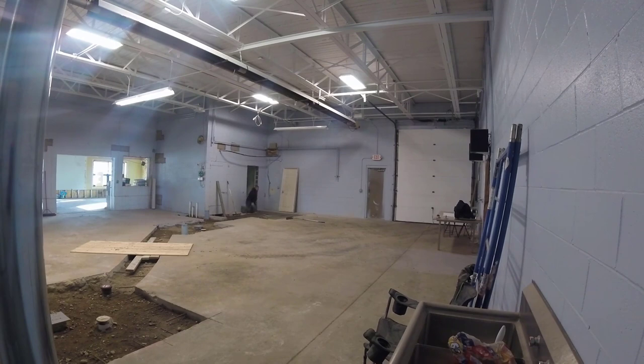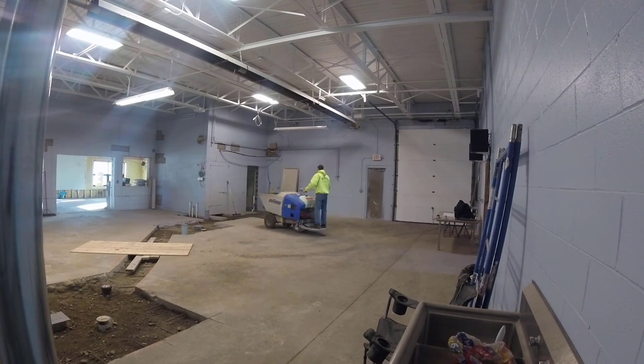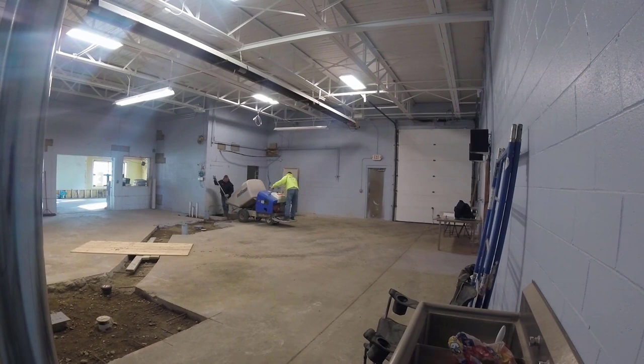They dug down probably 2 or 3 feet to put all that plumbing in. In that room in the back where that guy's bringing the wheelbarrow, those are a couple bathrooms. So those floors were all cut up in there. And then out here, they installed 3 center drains in those squares that we're at, and whatever else that other plumbing's for. So somebody else got it ready. They backfilled it. They compacted it. They drilled it and pinned it for us. All we had to do was come in and re-pour it.